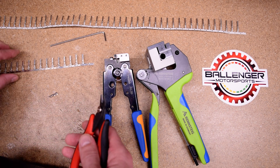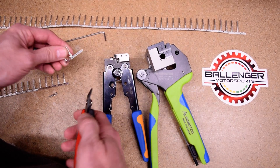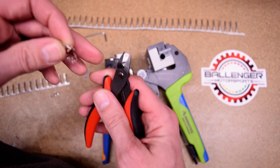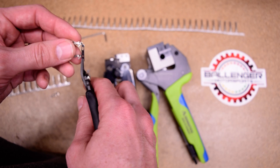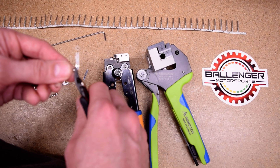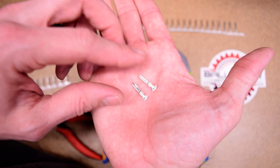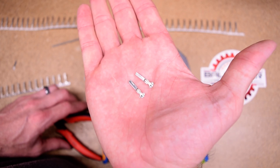One simple method is to take the reel segment that comes off the reel and clip off some of what you need. We can cut it with hand flush cutters specifically. It's important to have the right tool — a flush cutter is required so that we don't have any flashing that comes off the back of the terminal itself. We've got terminals that are in good shape with no extra flashing on the back of them. This is slow and tedious but it's effective, so if you don't need to invest in additional tooling then this works fine.